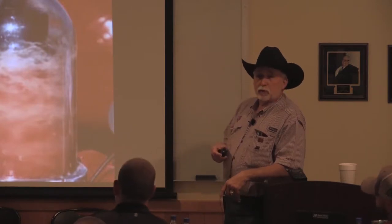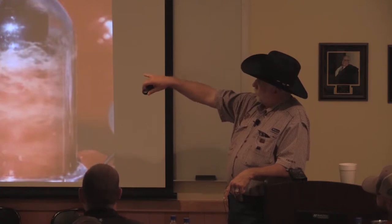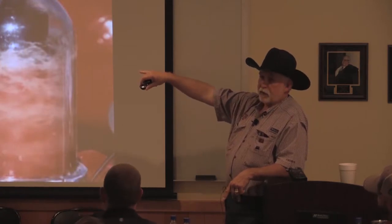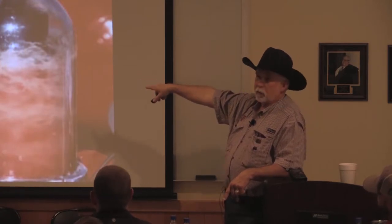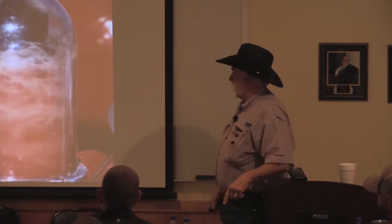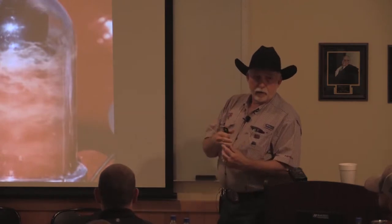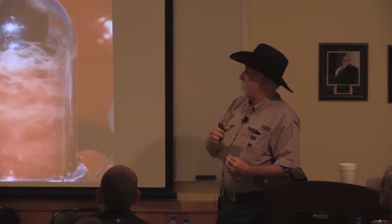So my personal preference for filtration is disc filters. You look at the filter on the left, that's actually supplying the clean water that's coming into this filter on the right. And the way this works, the spline assembly that those discs sit on have holes at an angle to the disc, okay?